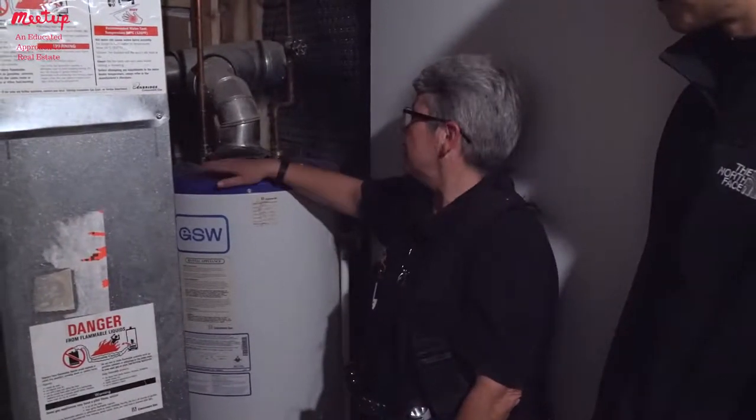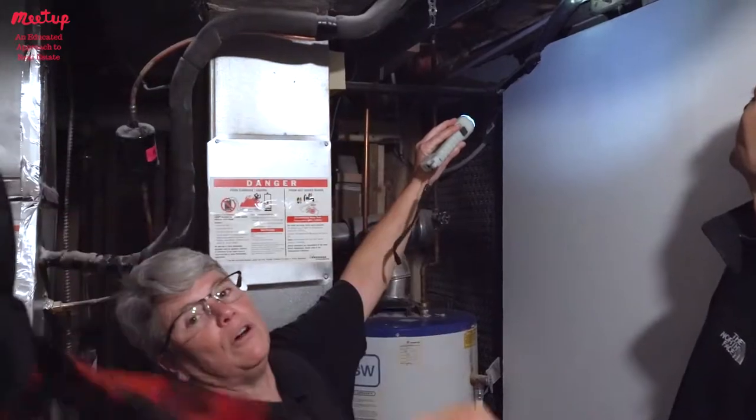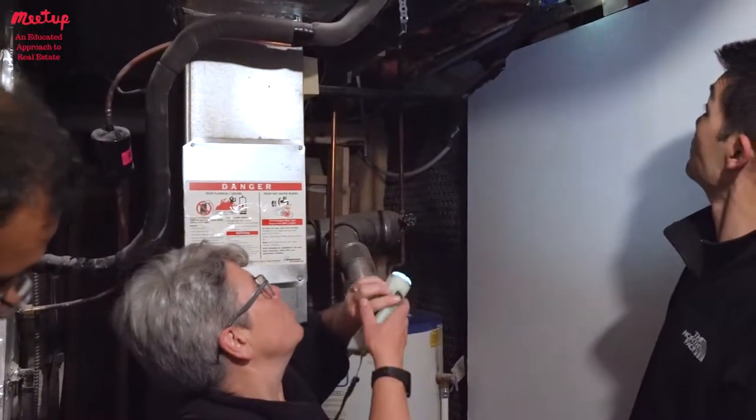They could go at any time — no guarantees. You can see the epoxy injection repair in the foundation. They've had a crack, which may have happened due to local compaction — something settled or shifted right after they poured it. I've seen it on a number of newer houses. The epoxy is basically there just to seal for leakage; it's not a structural repair. You have to monitor for further cracking.